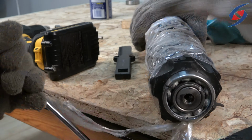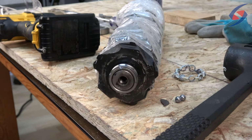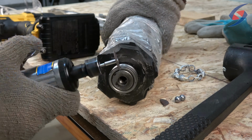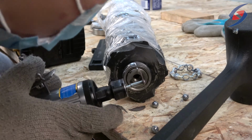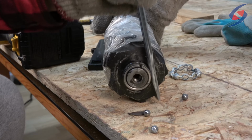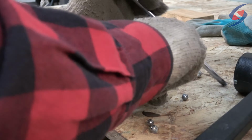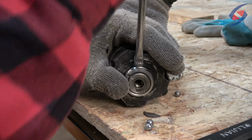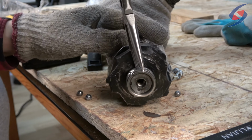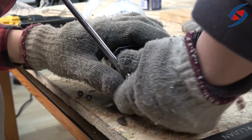Repeat this step and remove as much as possible of the bearing components until you reach the innermost ring of the bearing. Repeat the initial cutting procedure with the saw and chisel the part until the whole bearing can be removed. Now the bearing is fully removed.